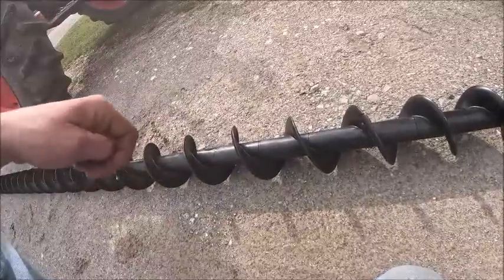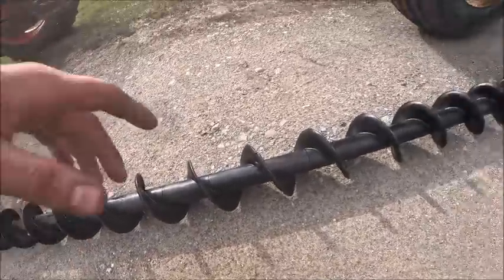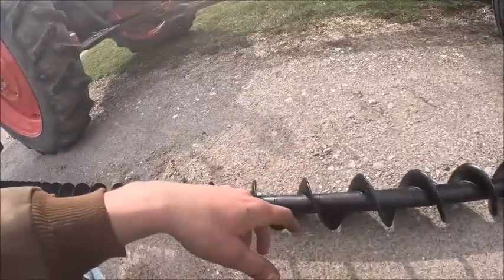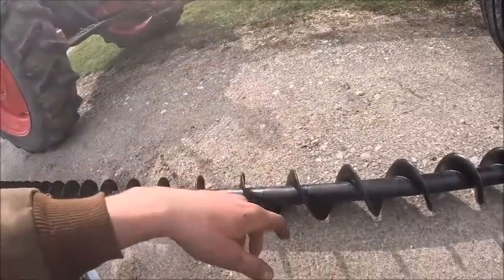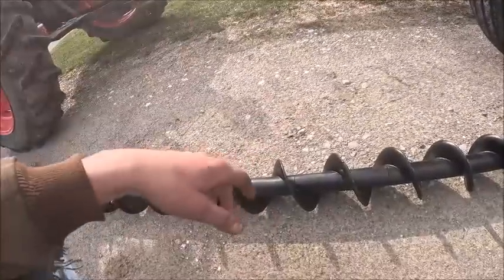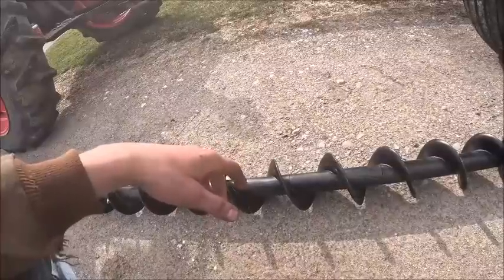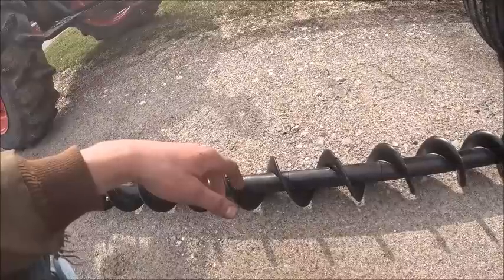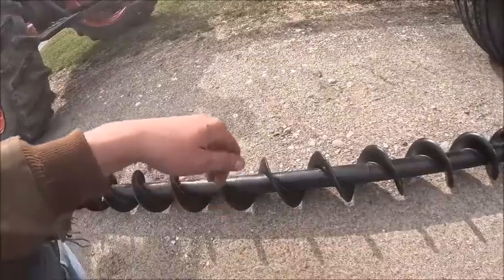The whole point of this auger design is basically gentle seed handling, although the best way to handle seed is actually a conveyor, which is why most modern seed tenders that you set your boxes right on and just tend right out of the box, or even most hopper style seed tenders for that matter, use conveyors instead of augers.